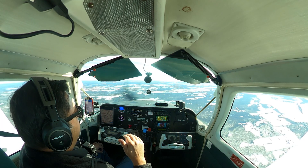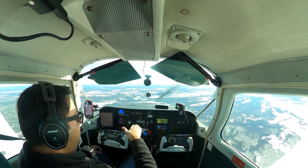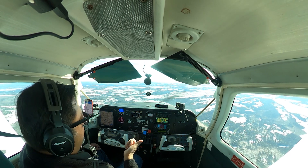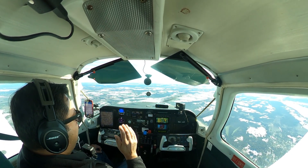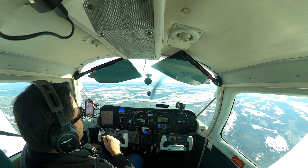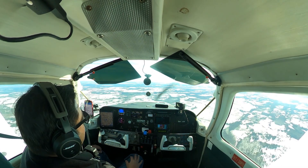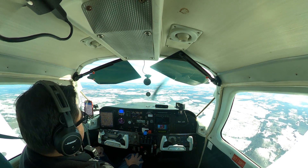Now the localizer — that's kind of where I'm having a minor issue. The way it's supposed to work is that when you're on an approach and getting close to the glide slope from underneath, when you intercept it the autopilot is supposed to capture it and start the plane descending, tracking the glide slope all the way down to minimums. What I found during tests with the avionics guy after my panel upgrade was that it would kind of recognize the glide slope but then instead of a gentle descent it would actually dive — like a falcon going after a field mouse. Before my panel upgrade I never used localizer mode to capture glide slopes anyway, so it's no loss of functionality, but it would be nice to have it working.